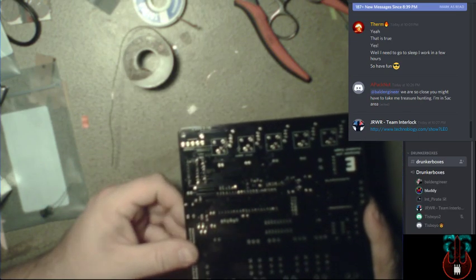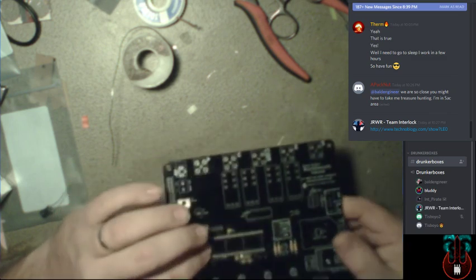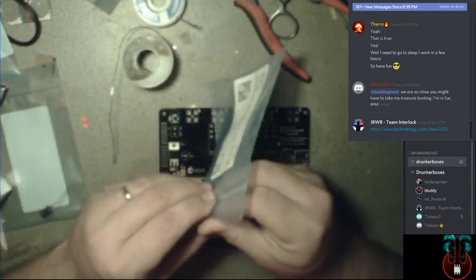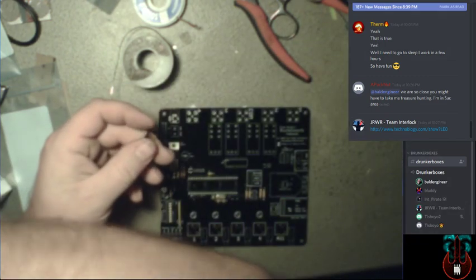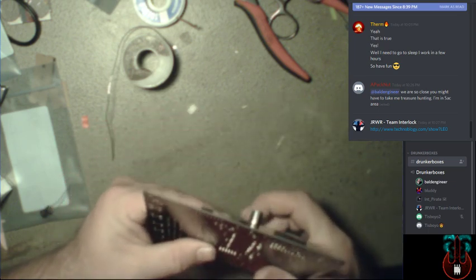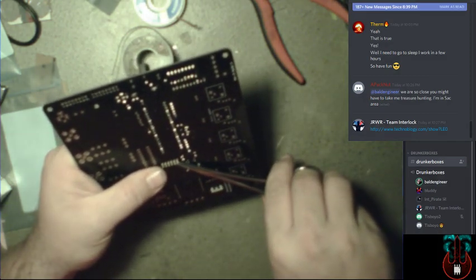Yeah. I've tried to create some time-sensitive systems with digitalWrite, and I had to go and look up faster methods because it wasn't going to cut it. Well, digitalWrite is inherently slow, which is why it doesn't work in time-sensitive code, because it takes forever to do something. So interrupts wreak havoc with it.